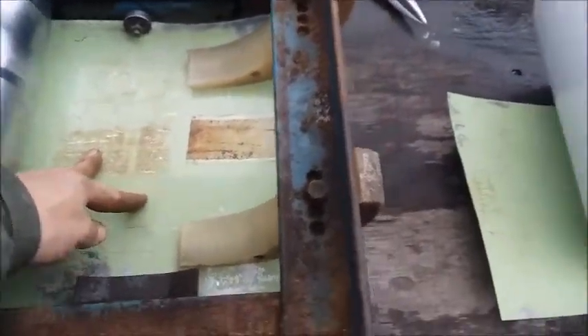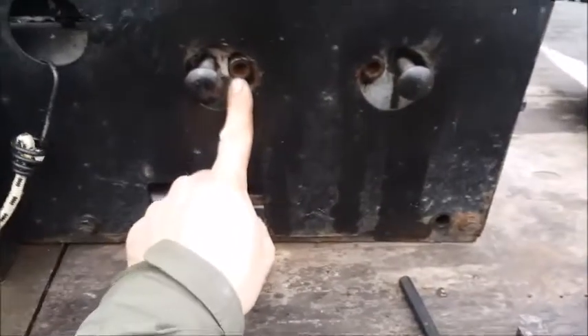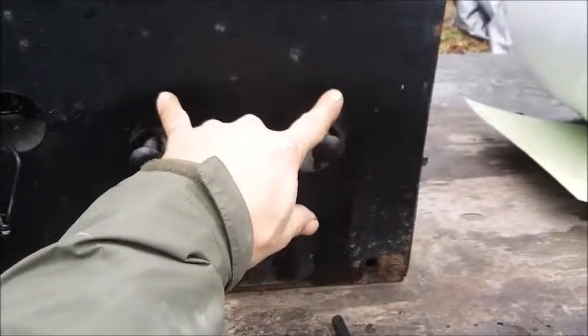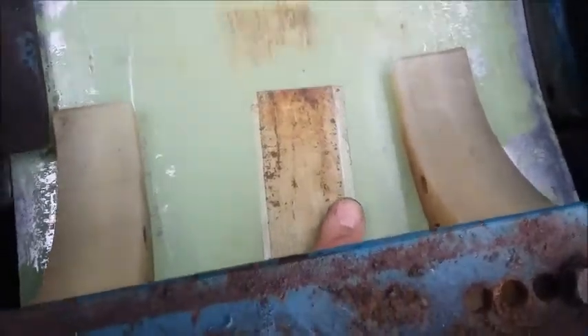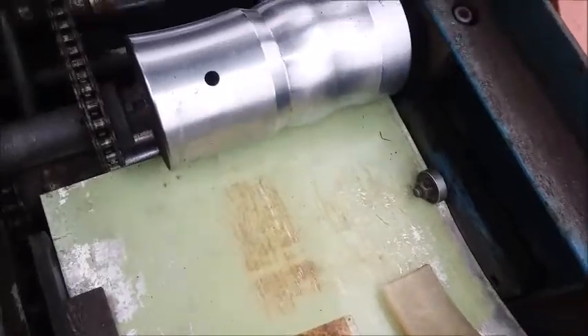What I did was cut off a piece of the coil so I could slide it in there, and then using these adjuster screws — there are four of them — two of them move the slide in or out and the other two lock it into place. I got it so that the piece fits just right, with about a 32nd of an inch worth of play going back and forth. So now this should hold my coil to the right side of the machine so that it can get a proper edge.